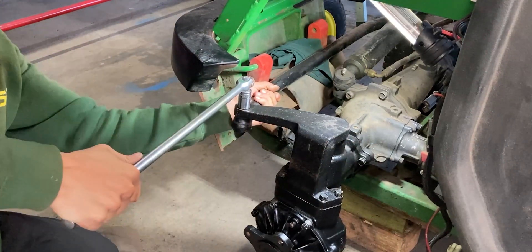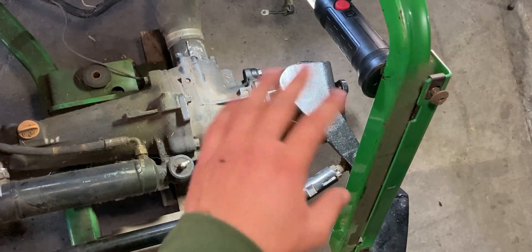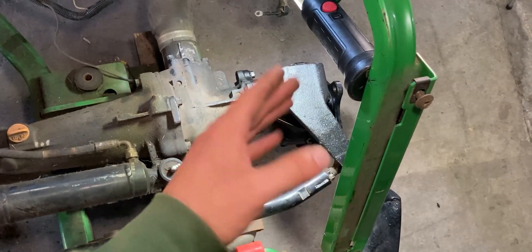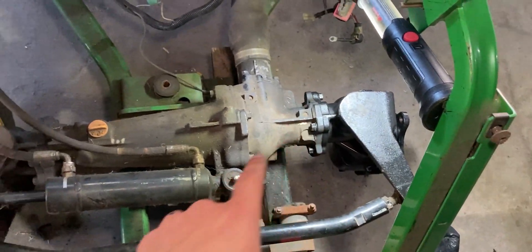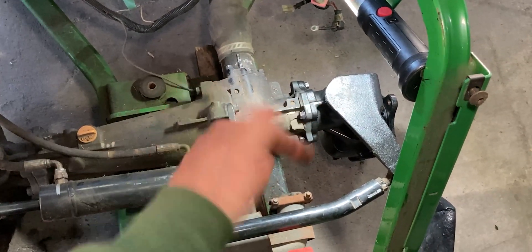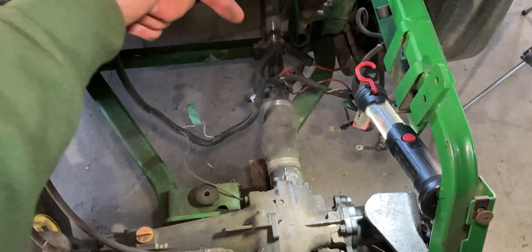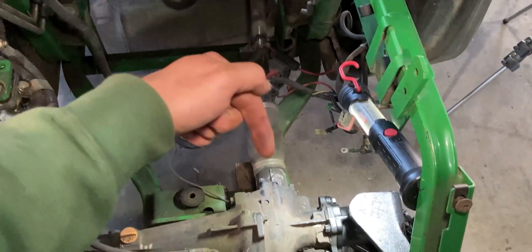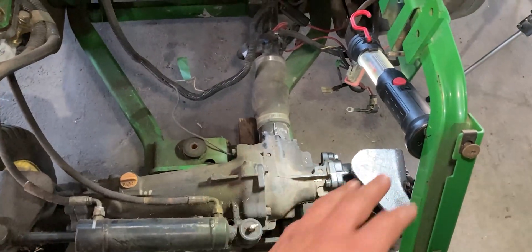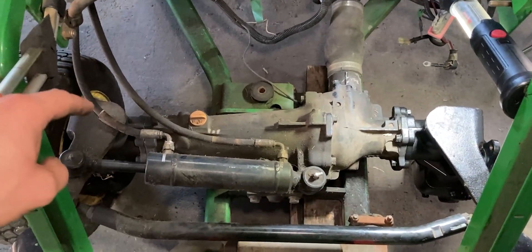Let me give you guys a quick look at the rear axle before I put on the right tire. This is the portion I repaired with brand new seals and sleeves. Everything else — the bearings, gears, shafts, and cast parts — was still in working order, so I could reuse everything. This part was hooked up to the main portion of the axle and is bolted on with four bolts going into the cast part one way, and then one more bolt going in the other way because there wasn't enough room from this side.